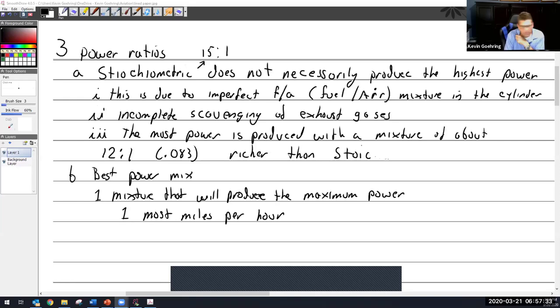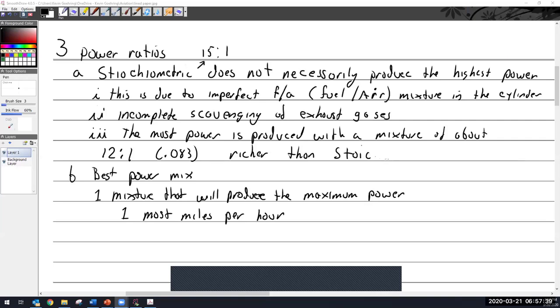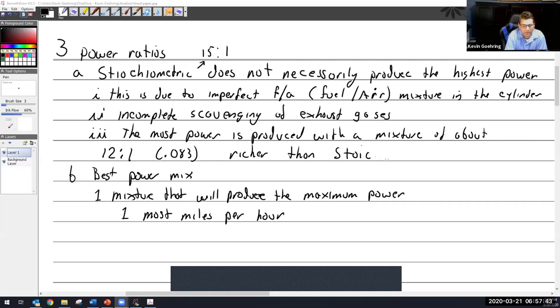So I'm doing a couple things at once here. Yes. So I need to get more horsepower. If I get more horsepower, I'm going to go faster. Like in my airplane, we can make it simple, a 150. So I don't have the prop knob. So I get up to altitude and I want to get somewhere quick. Say I'm at 5,000 feet or even 6,000 feet. So I start pulling back on my mixture, pull a little bit, little bit, little bit. I keep pulling it out. You have to go really slow and I'm going to watch.